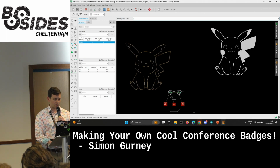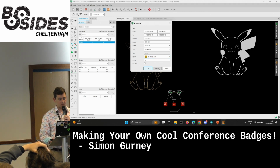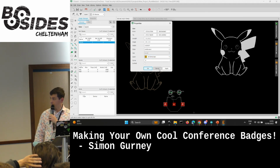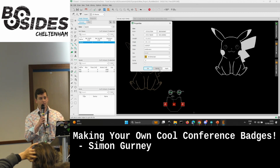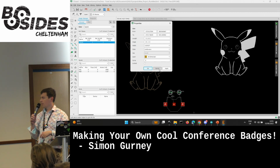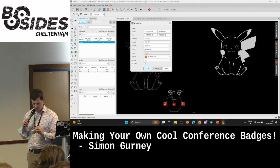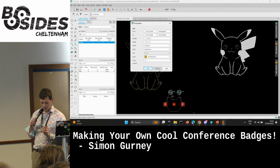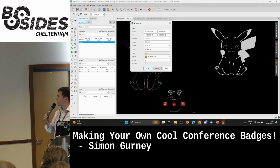And then this Pikachu over here, we can see what layer he's on. He's on dimension. So this Pikachu is going to be the cutout for the board. The dimension layer is used to do the perimeter of the board, so it knows exactly what to mill out. But also, if you want a big hole in the middle of it, like on the DeLorean here, you've got a cutout for the clasp of the lanyard. That'll be on the dimension layer as well.